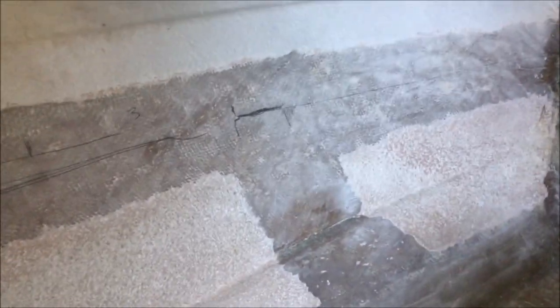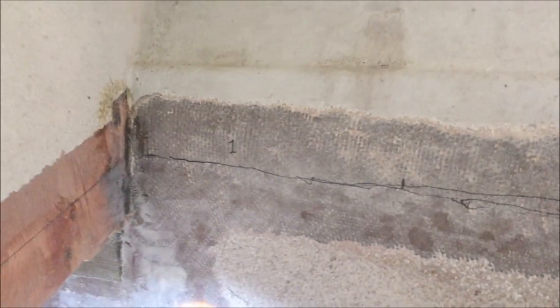And also, I have my bunk structure supports that go along the side of the boat here. I have those cut out, shaped, and in resin, and they are ready to be peanut buttered and glassed in. I've been waiting to put the main bunk structures in that go here, that I think I've shown in some other videos. I've been waiting to put those in after I put these in, because it'll be a lot easier to glass and tab on the underneath of these without that stuff in the way. So that's been the holdup for that. But I got those ready to go in, so the next time I work on the boat is probably going to be to put those in.